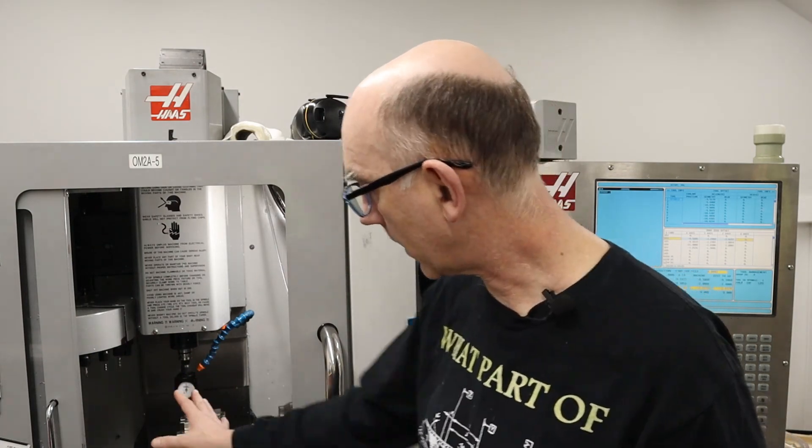This means I can turn the machine off — since this is a hobby and sometimes I have to wait till another day — leave everything in place, come back later, and the registration will be exactly where it was. It also means that as long as I have Z set to the top of the parallels, I don't have to re-pick up Z before each job. I'm absolutely thrilled learning how accurate this is — it's changed my workflow so I'm mostly using the Haimer to pick up X and Y, not Z, since I'm using a consistent Z position. I hope you enjoyed this episode — please give me a thumbs up, subscribe, comment below, and I'll see you next time.